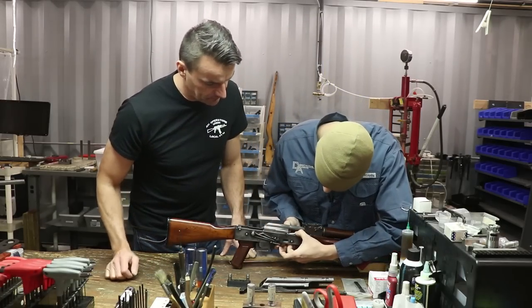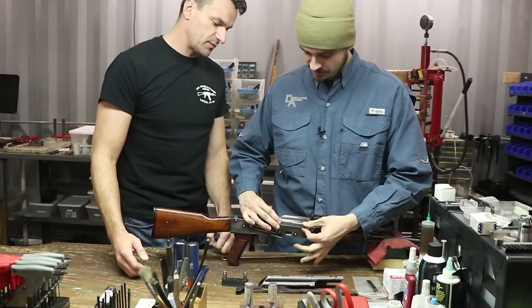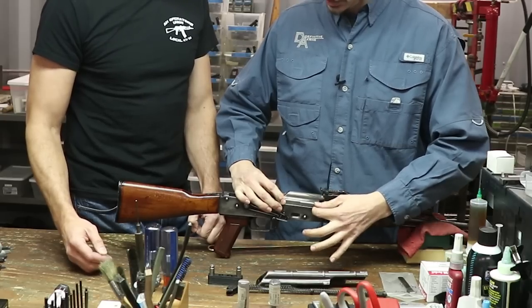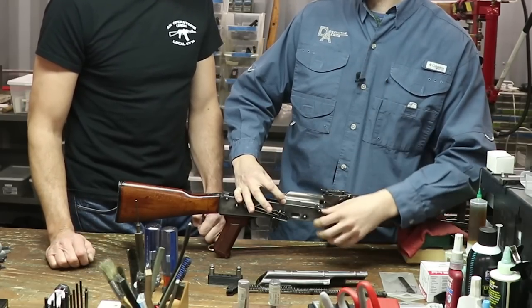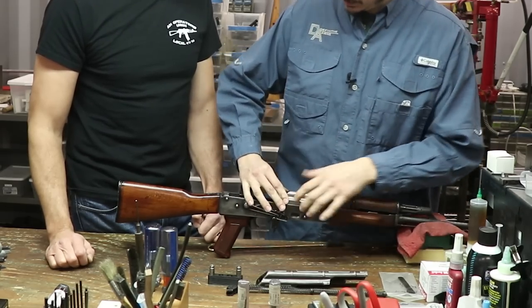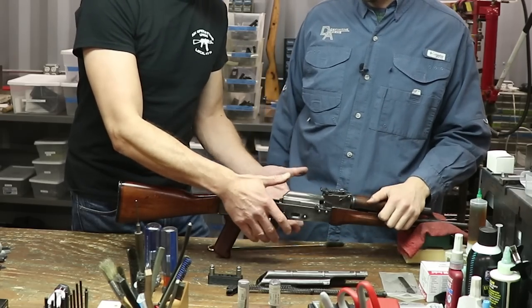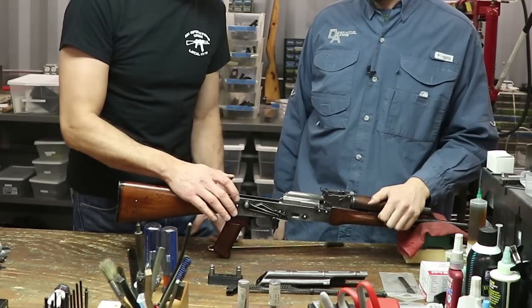If you're careful, you can come in, snap it underneath the claw and drive it in — you don't want to handle it too hard, but give it a little wiggle. Drive it around and make sure it's not just caught on a tight spot or a burr. And you can see, even with a good bit of pressure, this one doesn't want to close on the no-go. I'm usually just applying pressure with my thumbs and trying to push it that way.